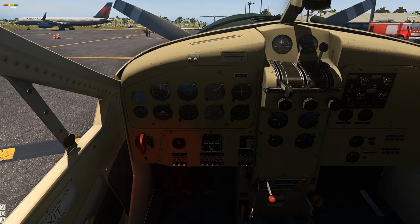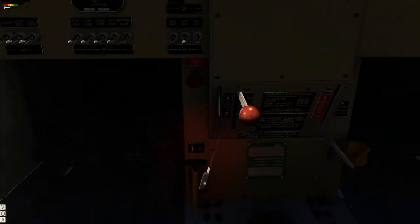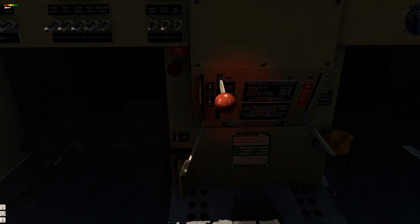What we're going to do is first select the front tank or any tank that you prefer. Then we go down to this red lever right here — that is a wobble pump. This other handle over here, which has a black handle, that is your kill switch, which shuts off fuel, oil, everything. It works, but you don't want to do that.